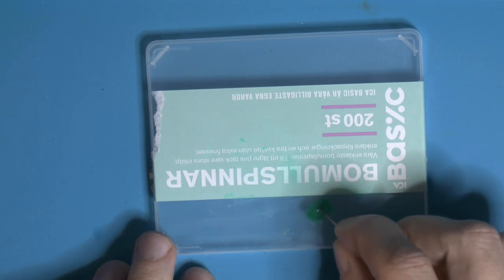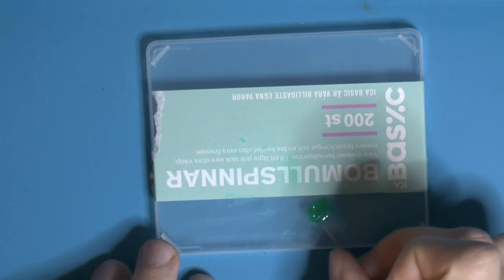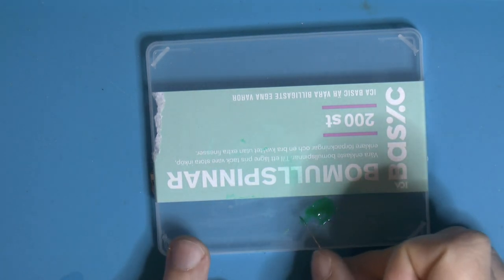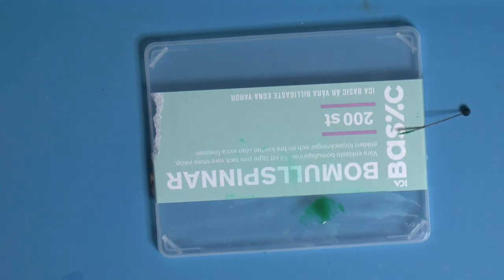I would like to fix that pad we had loose, cover that up and fix it in place, because this conformal coating is also like a solder mask. I suppose it's 2-in-1. Might be too thin, I don't know. We'll find out soon enough. But we're dealing with very small things here.